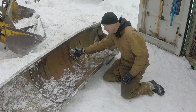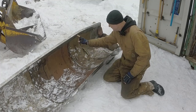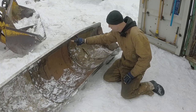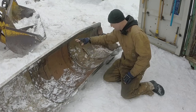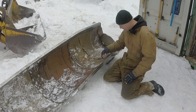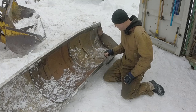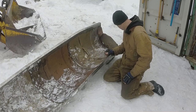So we've got these barrels overlapped, and the actual seam I'm going to cut on is right here where this weld is. It's pretty straight from here down — really straight from here to here, just a little wave to it, but after we get it cut off I think we can hammer that out. The bottom's pretty straight from this point down, so I think we can do away with this bad part over here that caught the stump and start working on making a new one.